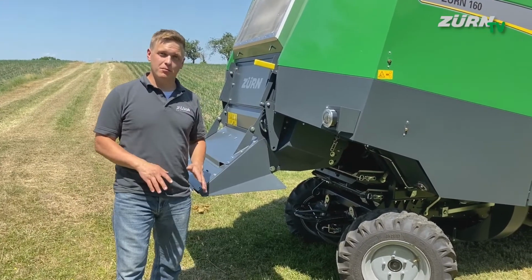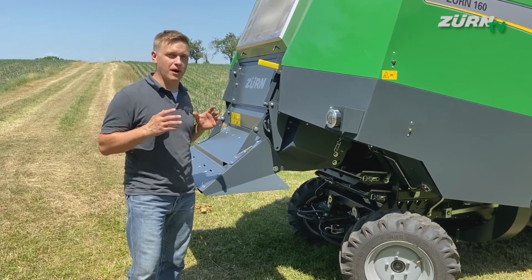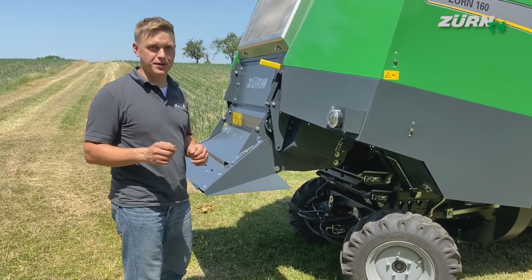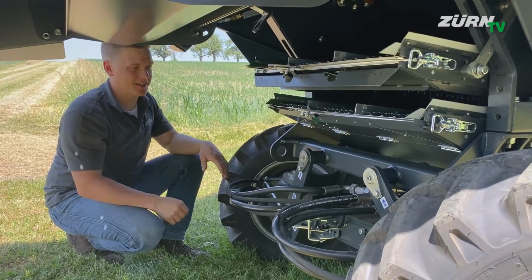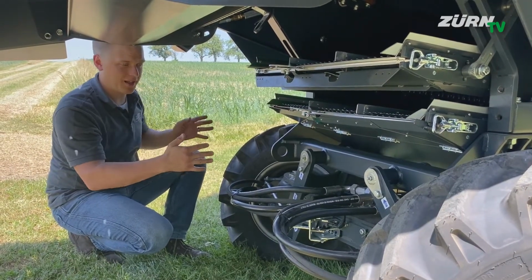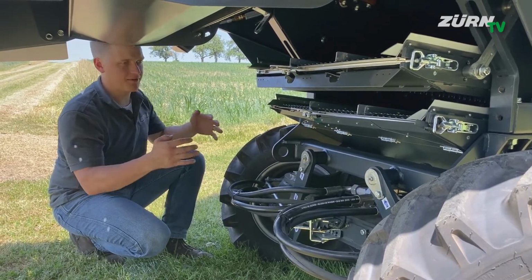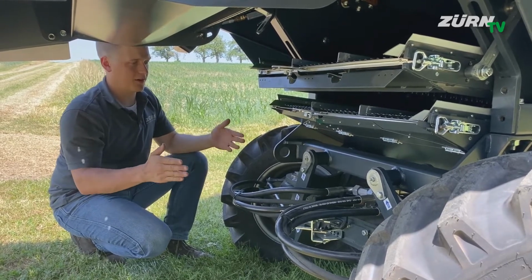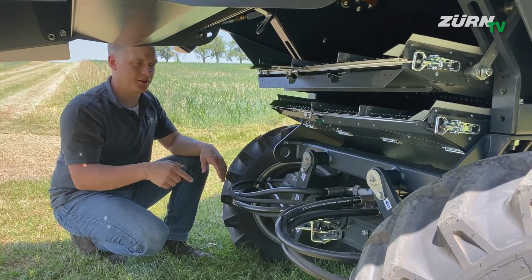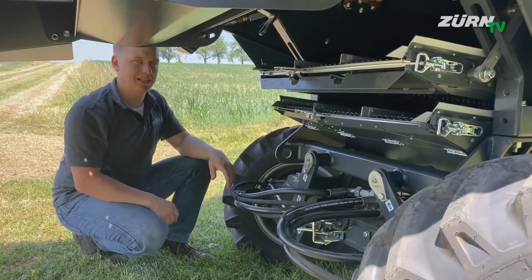After the functional components, we will now focus on what actually moves the combine forward. Let's start with the rear axle. This massive multi-link rear axle moves to the side while it pivots. That way we can allow enough clearance for the tires to be at full lock, like have a good turning circle, even in rough terrain, and the machine has a good stability.